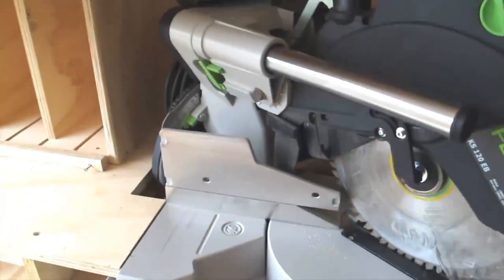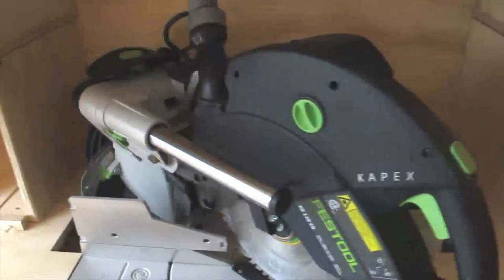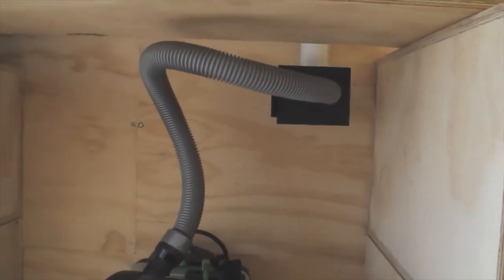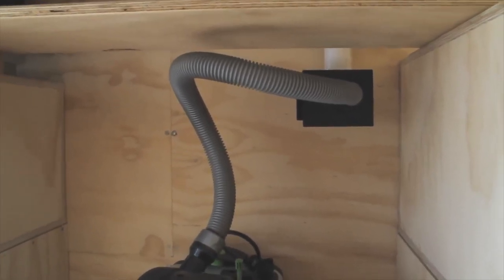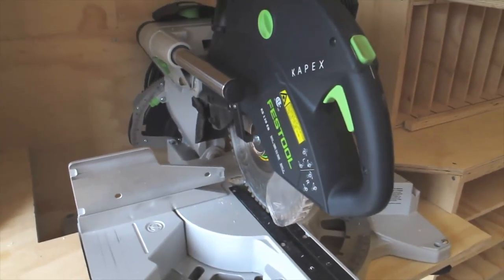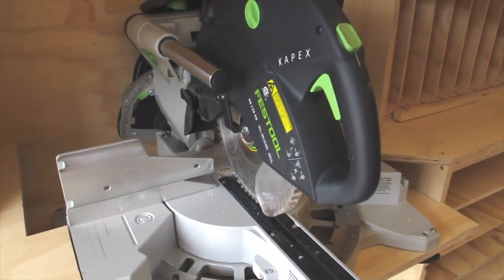When the saw is pulled out to that distance, I get full swing both directions, and I can also lay the saw over for combination work. Dust collection with the blast gate here — I can just open this up and collect dust when I'm using the miter saw. The planer collects dust quite well as it has a power fan that blows it out. The miter saw has the best dust collection system I've seen on any miter saw, yet it still probably only collects around 60 or 70 percent of the dust, so there's still quite a bit but it'll help.